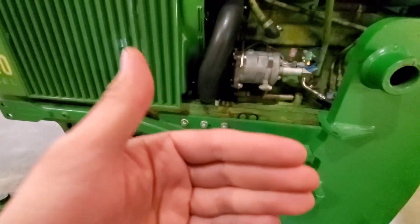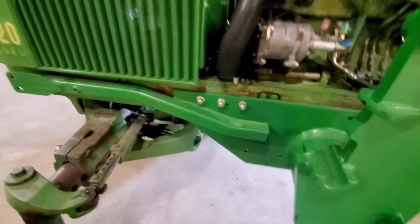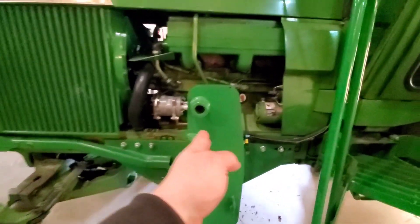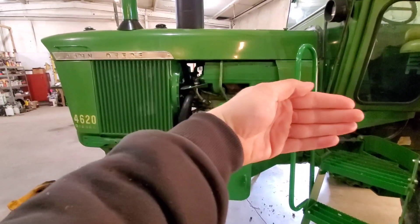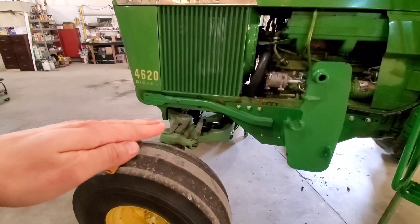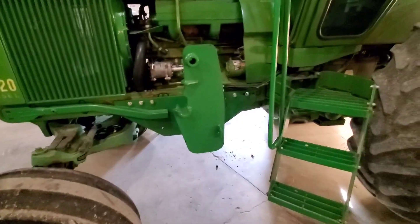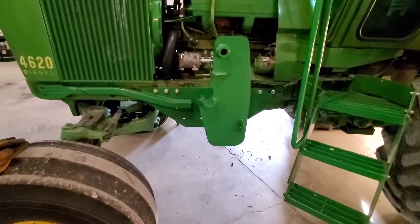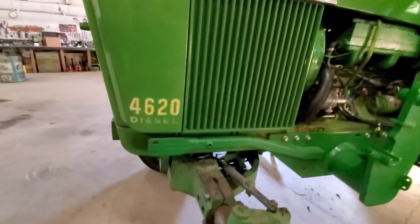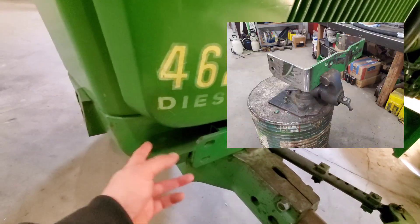That's because this loader was technically never made for this tractor. Because of the cast front end, the crossbar doesn't fit — this was not one of the selected tractors that this loader was designed for. But the mounting holes did line up, so I went ahead and moved it back, which brings our mast back closer to the cab, putting more of the weight towards the rear end and close-coupling the loader. There's still plenty of room. I hate loaders that are way too far out there — you go to cut grade and the bucket's doing this. The closer you get to your wheels, the smoother it is to cut. You do lose a little reach for loading hay, but that's not an issue here. Because this loader wasn't for this tractor, it would have been for like a 4430, which would actually be a little shorter without the bigger front end. This front bracket will have to be changed.